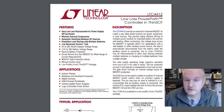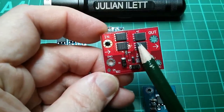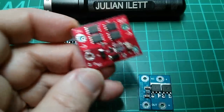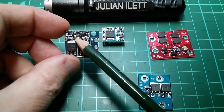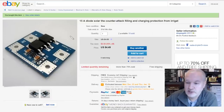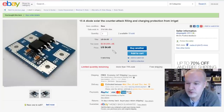I'm hoping it'll be ideal for what I want. The other variants: one has four MOSFETs facing each other — one pair pointing one way and one pair the other — with an identifiable Linear Technology controller chip and an on/off control, but it was about ten dollars. The one I just received was about four and a half. Then there are ones I don't think have a special-purpose controller chip — I suspect that scraped device might be an op-amp. I'll do a proper video on ideal diodes, but this one's looking favorable.